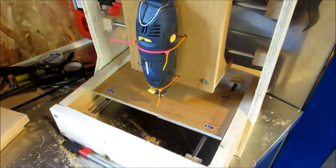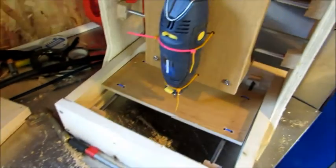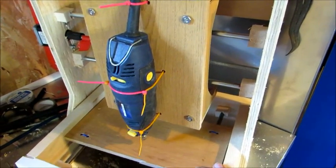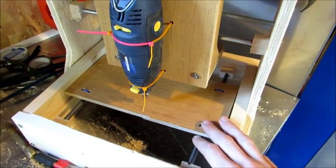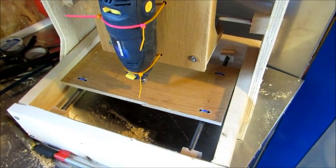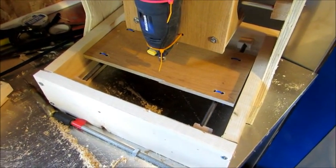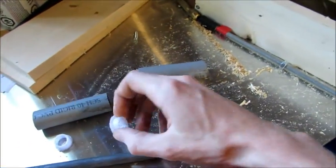So I've been building another one, and I kind of stumbled across a nice little, very simple linear bearing. The problem I had was that the bars are very thin — just 8mm — because linear bearings I can get my hands on for cheap were only 8mm, thanks to the 3D printing industry. But for CNC milling, you really want something a bit thicker, and anything thicker than 8mm just skyrockets in price. So, for a cheap alternative, I was building my own bushings.